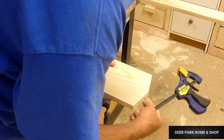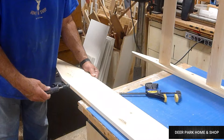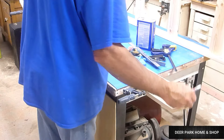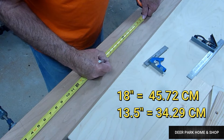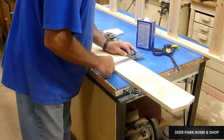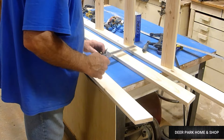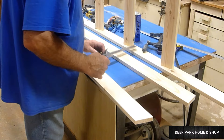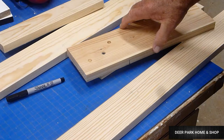Now we're ready to lay out our sides and position our ladder rungs, but first we have to do some measurements and layout. Put your boards together, flush them up and clamp them in place at the bottom and top. Measure up from the bottom 18 inches and mark — that'll be the top of your first rung. Then go up the ladder and mark at 13 and a half inch intervals. This will define the position of each rung. Using your square, extend your marks across the board with a light pencil line. Then unclamp and separate your boards and set your square at 13 sixteenths of an inch, bite it up against the side's front edge, and draw down toward the bottom of the ladder a couple of inches.